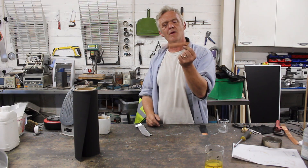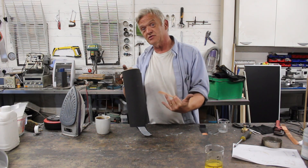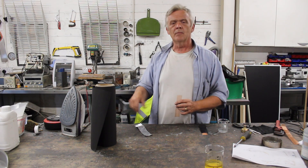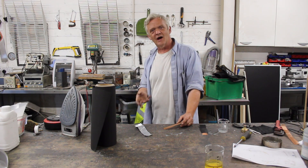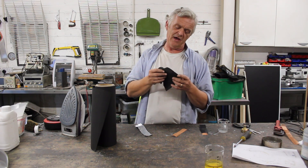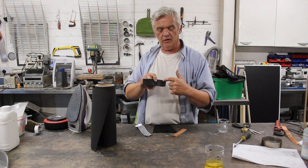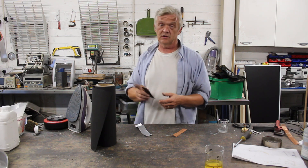To make the cathode we've got a bit of copper mesh and we need to wrap that in plastic. This is carbon-black-filled high-density polyethylene, which is conductive and protective, as the halide will just attack the copper. We need something conductive and protective around it, and this HDPE is relatively immune to halogens. Each halogen has its own properties, and iodine has a great affinity for carbon. I've got a bit of filter cloth from an air filter — it's an activated carbon cloth. The cathode has the plastic wrapped around it, heat-sealed with an ordinary household iron, and then I've run the iron over a bit of the carbon cloth to give a square of carbon on the bottom. You don't need to do that but it does make it a little bit better and traps the iodine in the pores of the carbon.